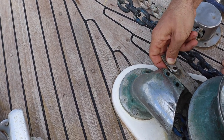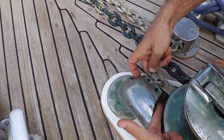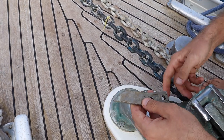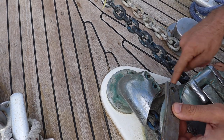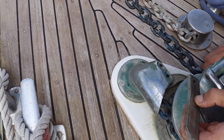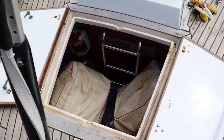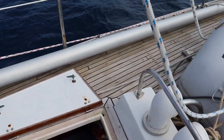What happened the other day when we were raising the anchor is it backed up, and the windlass kept pushing on it long enough to bend this out of shape. So this is not functional anymore — it rubs up against the windlass, and the chain does now ride up backwards periodically. The best solution we've found until we can get a replacement part is to have Dara down in the chain locker pulling on it while I activate the windlass.